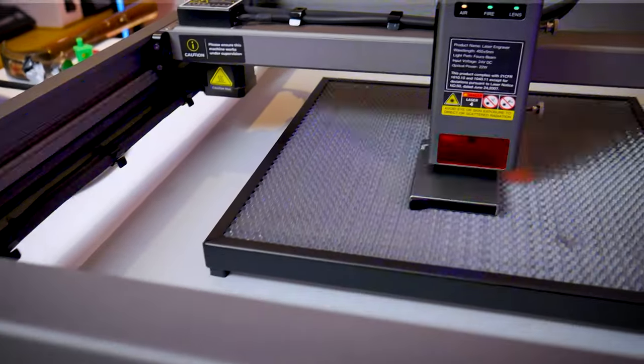There are a couple more things to do before we can start lasering again — we need to raise the entire frame using the included extension legs. We can unscrew one of the feet from the bottom of the frame, thread it into the extension legs and now take that entire assembly and thread it back into the bottom of the frame. Do this at all four corners of your machine. Now we can take our rotary attachment and plug in the wiring harness. On the back of the attachment you'll find a connector and one side of your harness will plug directly into that connector — it's keyed so you can't plug it in backwards. The other end of the harness goes to the plug located on the y-axis stepper motor on the inside of the front frame member. With the machine powered off, unplug that connector and plug it into the harness — this harness is also keyed so you can't plug that connector in backwards. Do not plug and unplug those connectors with the machine power on.